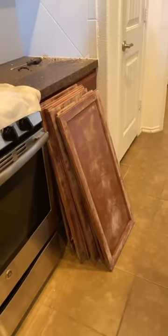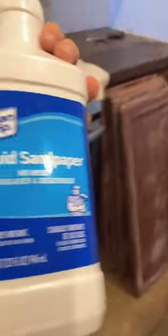I also did the doors — got to go over those with some of the deglosser degreaser. The prep work is so important when painting your cabinets. I went over the doors with that deglosser and then went over it with paper towel and water too, because it had a film left on it. Then I go over the cabinets and the doors with a tack cloth.